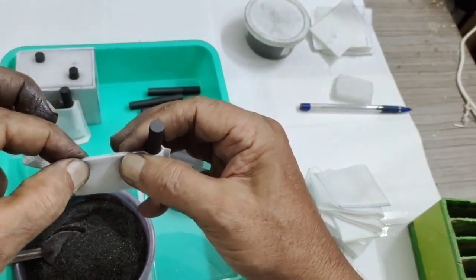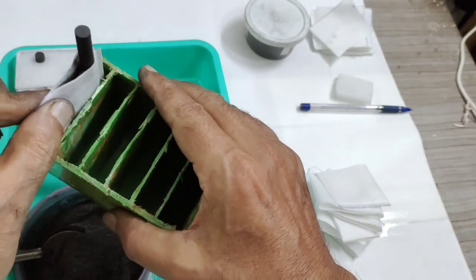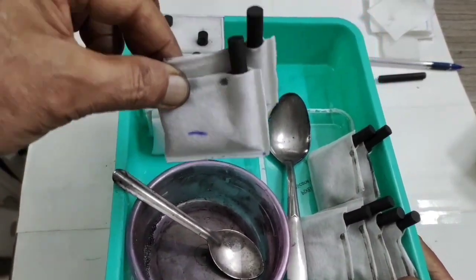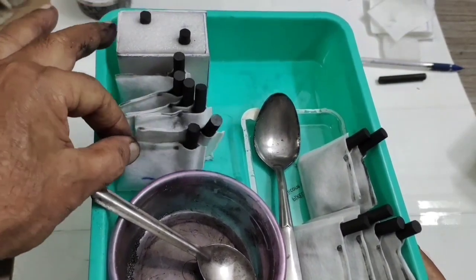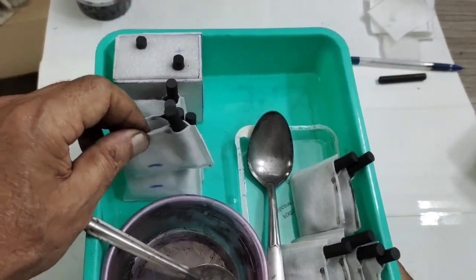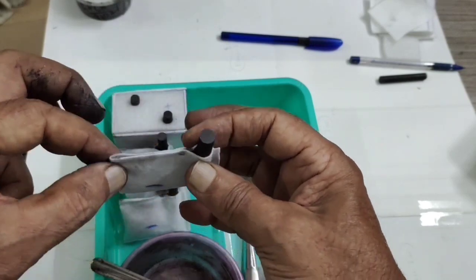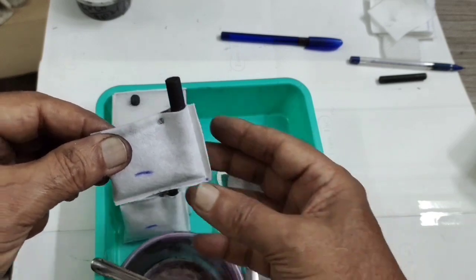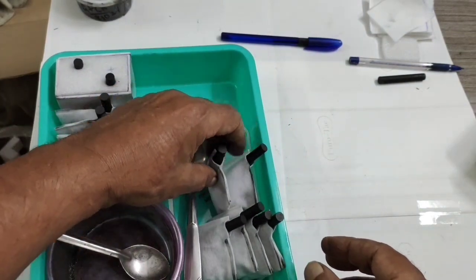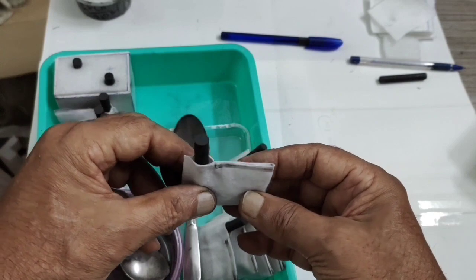Then finally we will make them closed so they become an electrode. These are all the negative electrodes — they contain a mixture of pure carbon and graphite. There are some openings which we will close using adhesive. For the positive electrode, we added carbon black and graphite in equal amounts, plus an equal amount of manganese oxide, then traces of lead oxide and cobalt oxide as a stimulator, and sealed on the top.